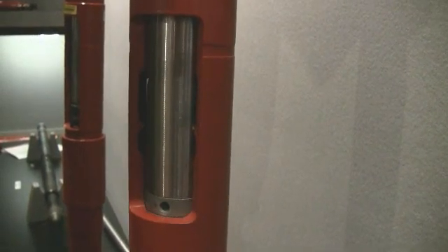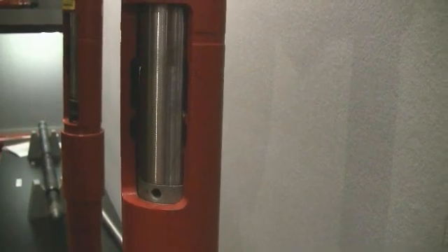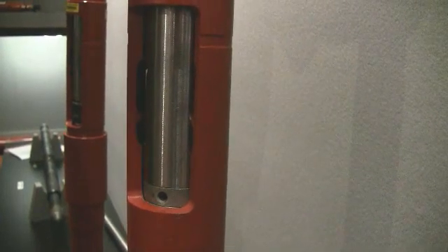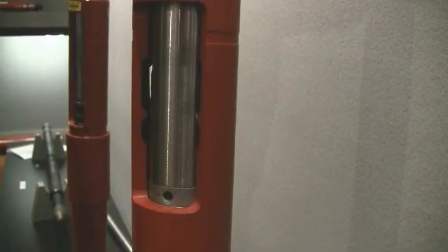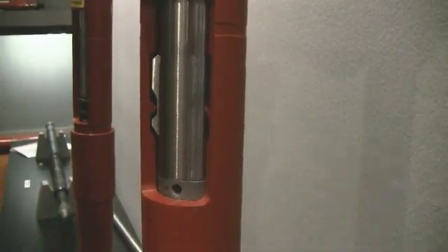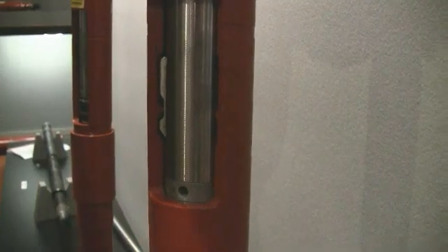The seals are now coming into sight. I can go no further — I've hit what we call the no-go, which is a restriction in diameter. I now hammer down with my running string. Watch the dogs — they are now locked in position. This tool is locked in the well.